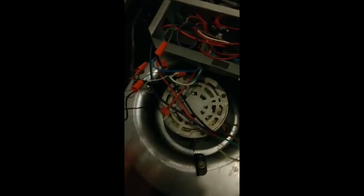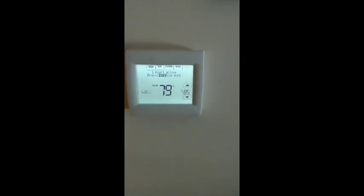We came back in to install the float switch. What we've done is just break power between red — everything else connects normally: fan goes to fan, heat goes to heat, etc. Once we got that installed, this is where it connects. Right now it's saying we're not connected because we have the disconnect pulled.